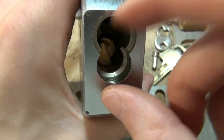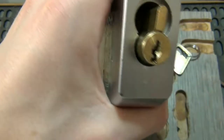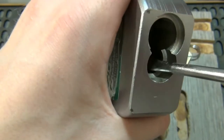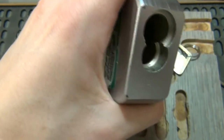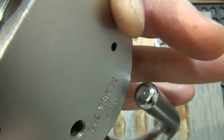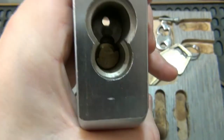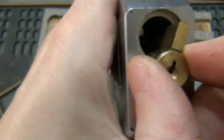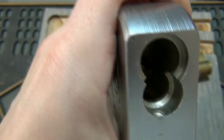It's going to be the bottom of the lock. Drop it in — it needs to go far enough in where the cylinder can drop down far enough so the bottom plate will fit over. If it's not dropping in, you can take a flathead and wiggle it around until it drops all the way in. You'll notice there's a half moon on the actuator and a half moon on our cylinder. The cylinder is going to be fitting in this direction, so this needs to sit next to it completing the full circle.